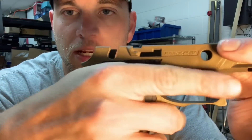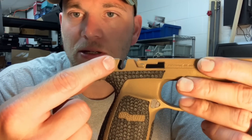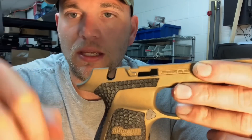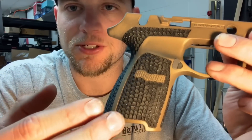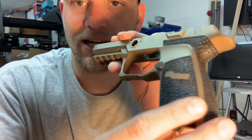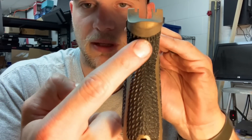Some of you are probably wondering about this cut — this is going to a guy in Massachusetts, so they have to have this cut out for a manual safety. The stippling comes around to the back, and this gator pattern is directional — it's all going one way. The way I do that is it's stippled in rows. Where the stippling meets, this side is stippled the opposite direction, and when they come together it makes a nice uniform look — you can see there's almost a straight line where everything ties together.